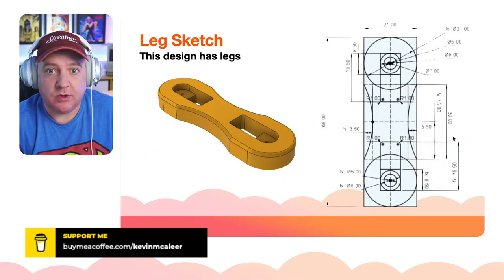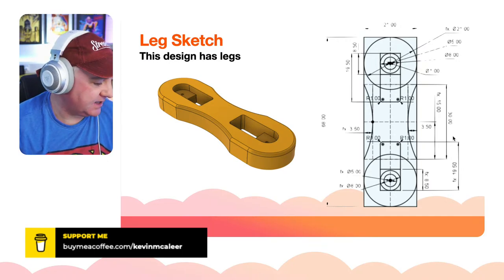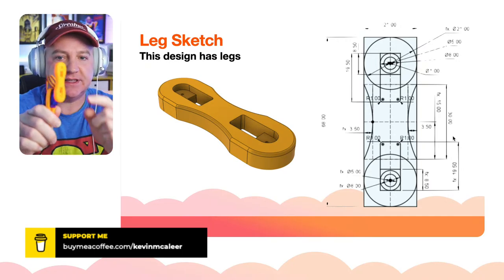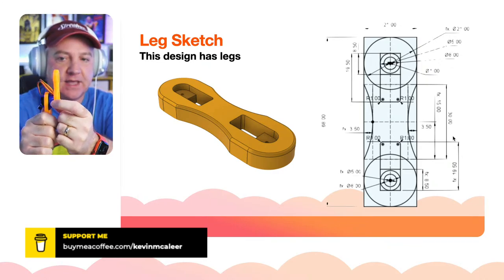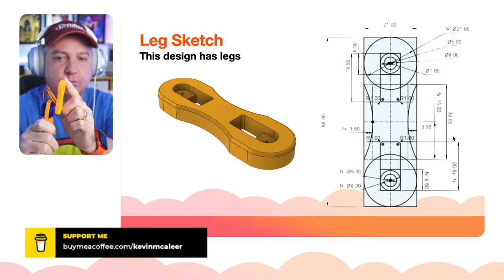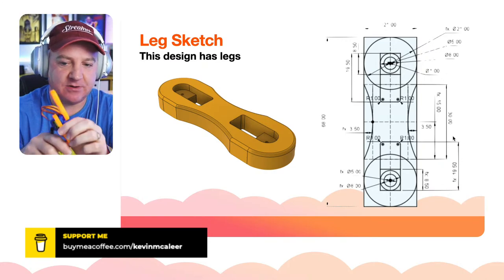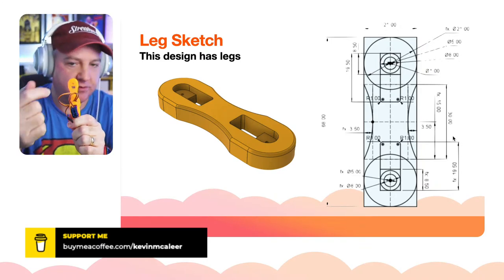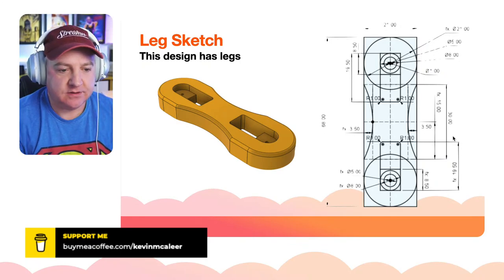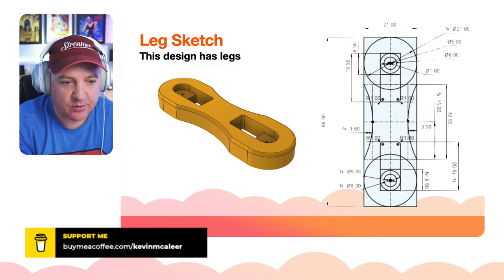The leg piece, and we'll model this up in a minute because I think we've got enough time to do this one. It's a nice shape, this one. I find this really aesthetically pleasing as a shape. So that's this piece here. It's quite thick. It's about eight millimeters thick, with, let's say, a 1.5 bevel fillet on the edge to make it nice and round. It's got these interesting sort of cutout shapes, and on the back it's got a hole as well for the servo to push through. So we're going to model that one up as well. Just an interesting design to work on that one.